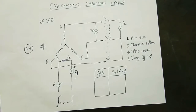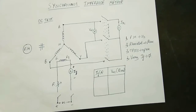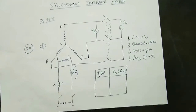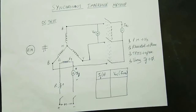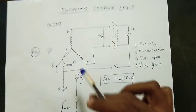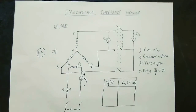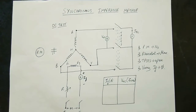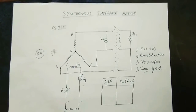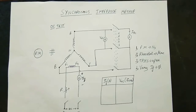You can increase the speed to 1500 RPM — that is the synchronous speed. We have two coupled shafts at the same speed. First thing: vary the prime mover to reach synchronous speed — that is the alternator's rated speed.